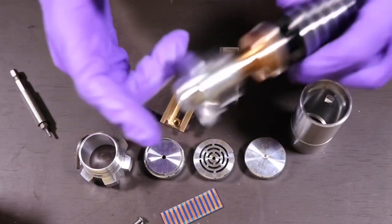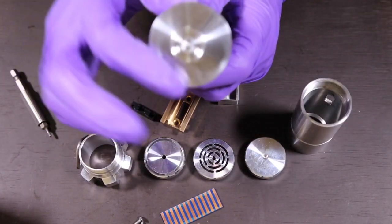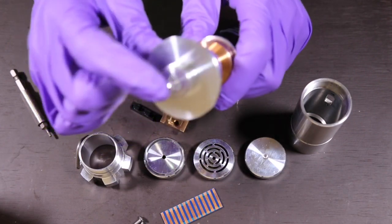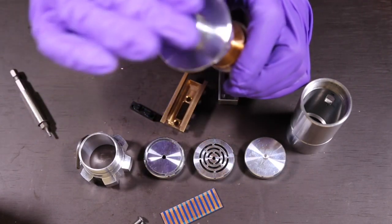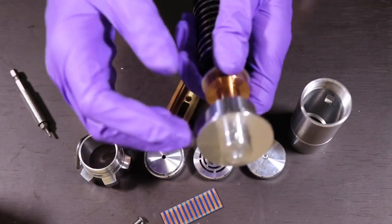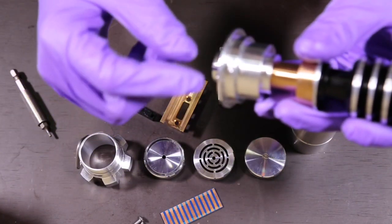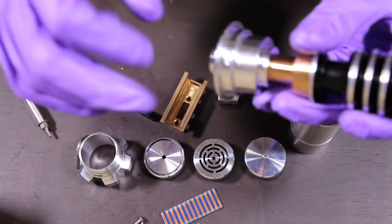So then you get to the front of the hilt. The static end cap here, we produced all of the individual artifacts that were part of the original prop. We've got the original turning marks here, and the texturing. It's not a straight cut, but the original prop has this turning. We've got the mystery divot that shows up here, which we later found out is a sunken slotted screw that has been ground down and then covered in paint.